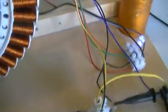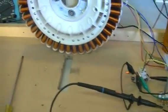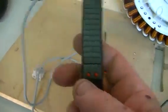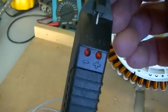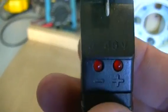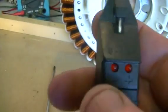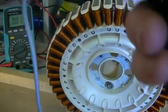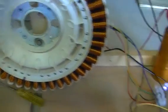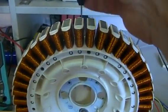So there's another little party trick here. What we have is a little test light that measures from three to 24 volts. One LED tells you if this is the positive end and the other LED tells you if that's the negative end. The stator core is isolated from everything — I'm just going to clip one end of this clip lead onto our negative rail and stick this on here.